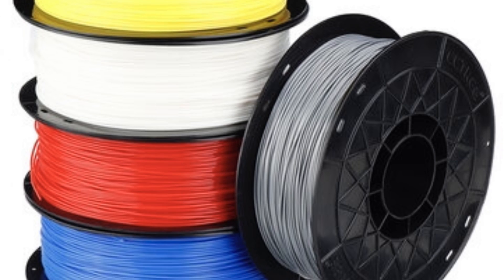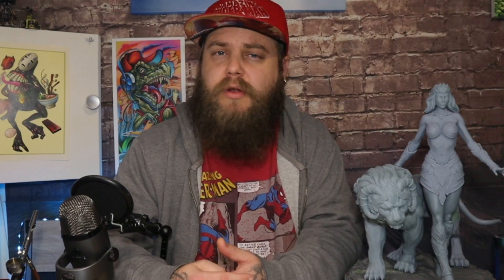FDM machines use a filament that comes on a roll, available in multiple types of materials and many different colors. Common types include PLA, TPU, PETG, and nylon. Each type has its strengths and weaknesses. PLA is the general all-purpose material — most people print in PLA as it's easy to post-process and can print 99% of what you want. The details held in PLA are usually extremely accurate, and you can even get multiple types of PLA.